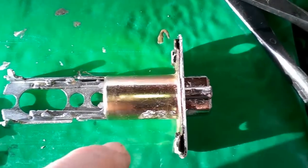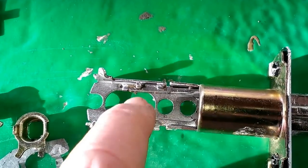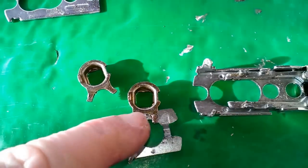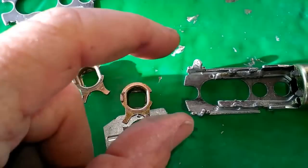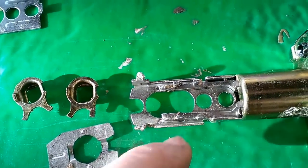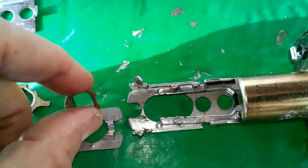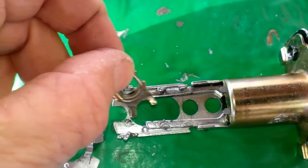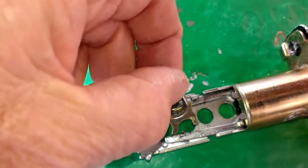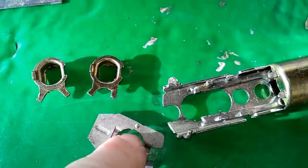You can see the little pins right there and right there engage with these pins here, and they're bent. What was happening was when I turned the handle - which turns these things - it wasn't engaging the retractor pins. It was slipping over them because they had gotten bent.